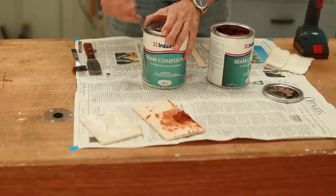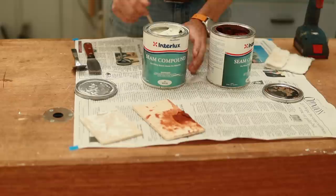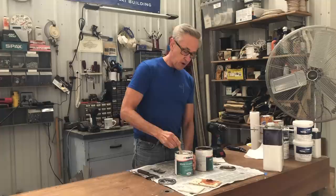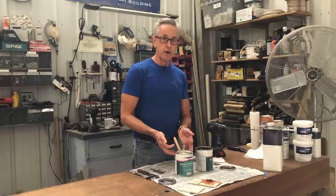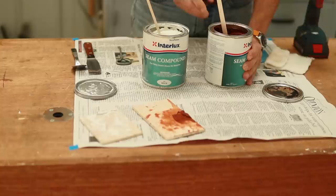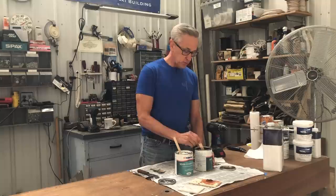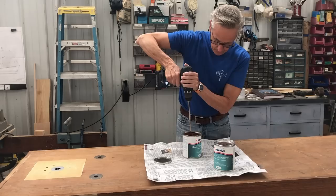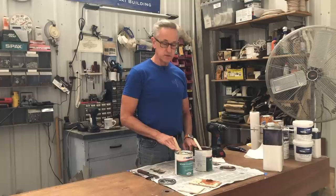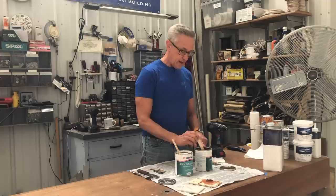They're really two completely different beasts. The white has a very smooth texture — most of the dissolutes had floated to the top when I first opened it. The brown, as opposed, is actually very stiff, and most of its dissolutes had floated to the bottom. So what I did was I took my drill, put a piece of wire in it, and stirred them both really, really well. Both systems work on the same principle — there's a binder so they stick to the seam, but they remain flexible on the inside.